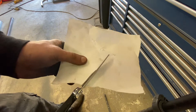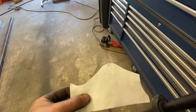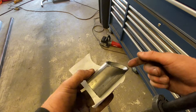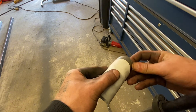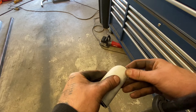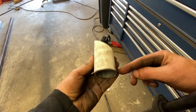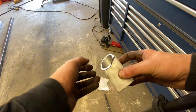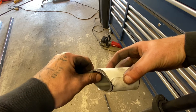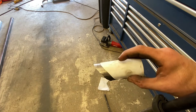There's our template. You're going to go back to your original tube — I'm just using this cut as an example here — and line it up on the edge where it was originally, or just make sure this line is straight right here on the bottom and use that as a reference. Then when you have it where you need, you just slip it back till you hit your mark and then you can make a quick, easy line on there.